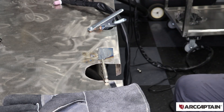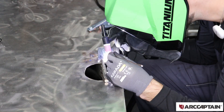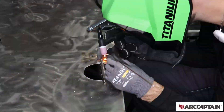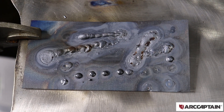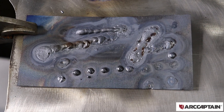The next thing I'm going to do is try to form a puddle and then just add a little dab of filler metal — try to do that until I feel comfortable with it. I'm not trying to make a bead or anything, just get a puddle and put a little dab in there just to get comfortable adding in this filler. This is definitely hard to do — it takes a lot of skill and practice, but hey, this is where we're starting and we can only go up from here.